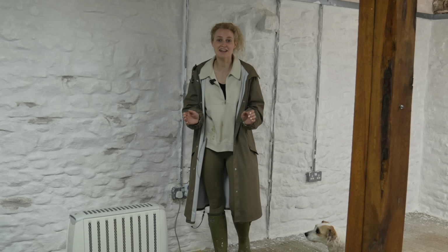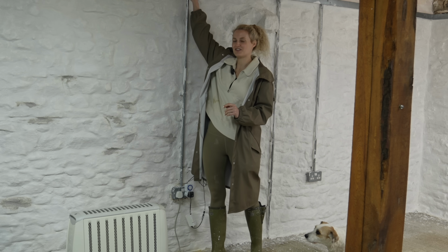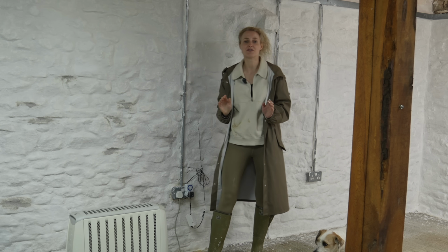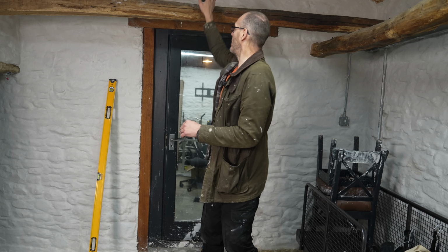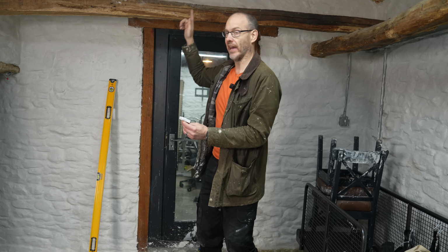So what's next? A little bit of tidying up to do around the pipework, the plug sockets, the roof line, and this trim. And we are going to have to use some modern type sealant to do so, and they're going to require this room to be a little bit warmer. The problem right now in here is that the temperature is cold. It's about 6 or 7 degrees in here, and the relative humidity is high. And even if we don't extract any of the moisture from the air, the humidity relatively will come down. So that's all going to be good, and will happen as soon as we get a split heat pump air con unit installed on that wall up there.